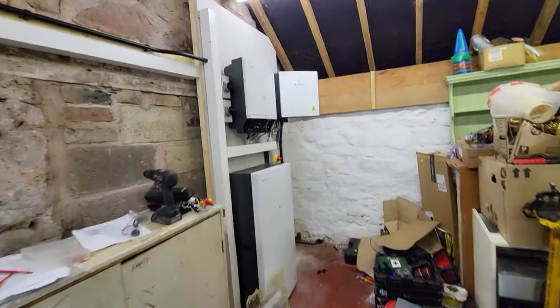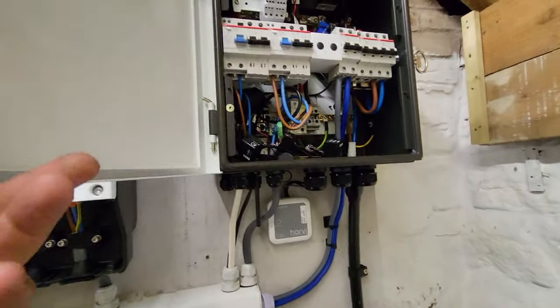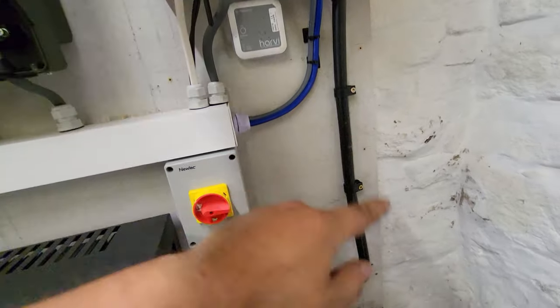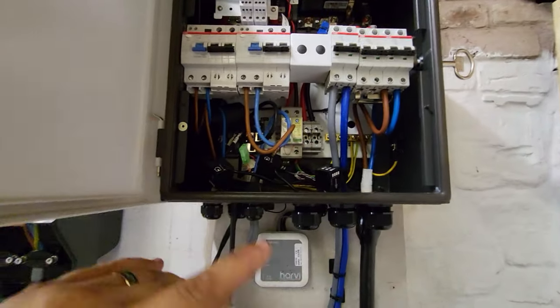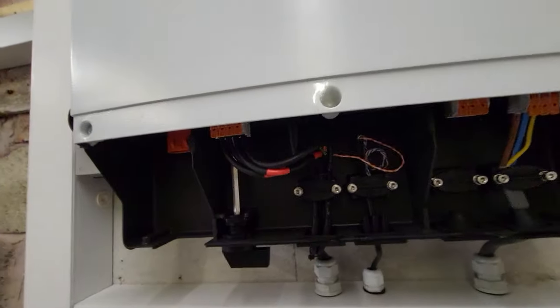So you can see using electrical OM how all this plays out and the issues with volt drop. Down to this point, obviously that's a consideration when you're running your sub mains back down and then away into your sub boards, you need to factor in volt drop. So don't forget that.